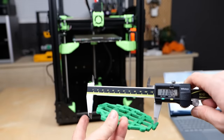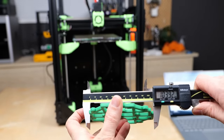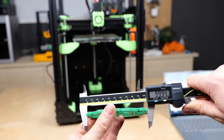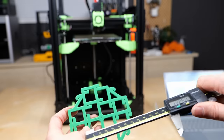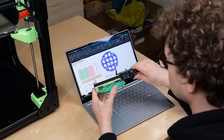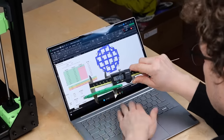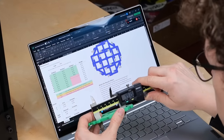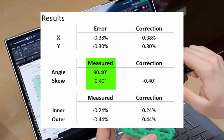Make sure to use proper calipers. I love my Mitutoyos with a thumb wheel that helps me apply consistent pressure during measurements — link in the description. Make sure the calipers are always parallel to the part and maybe even wiggle a bit to find the sweet spot. There are 10 reference dimensions on the part, and to reduce the effect of measuring error you should measure each dimension 3 times. This takes maybe 5 minutes, leaving you with the calculation of your X and Y error as well as the skew of the axes.